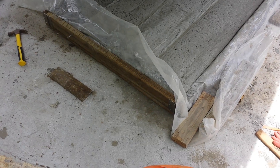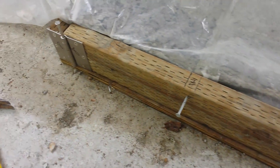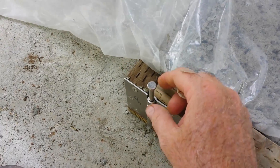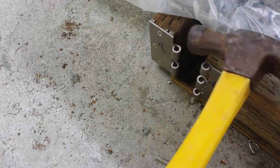We poured aircrete into the form yesterday, and this is what it looks like. You can see there are 1x4s there. I come here and remove the pins, the nails that are holding the 1x4 in. Then I remove the pin from the hinge, and that allows the outside piece to just come right apart and off.